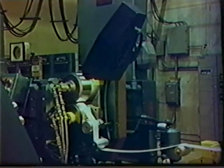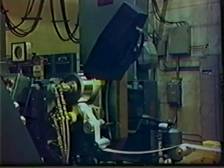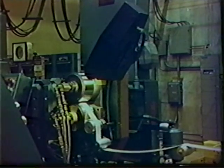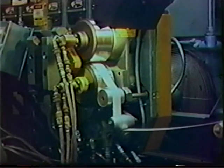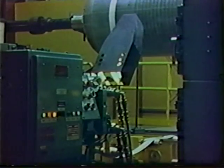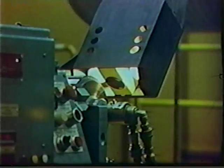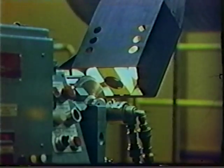The final dimensions of the extruded strip are regulated by a temperature-controlled roller die system and a special camera sensor. The roller die consists of two cylindrical rods. The width of the extruded strips is controlled by the camera, which senses variations and provides feedback to the extruder control system.